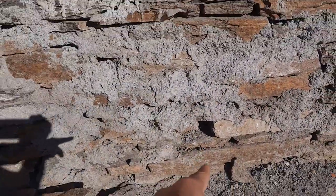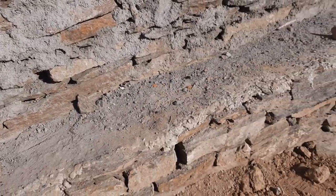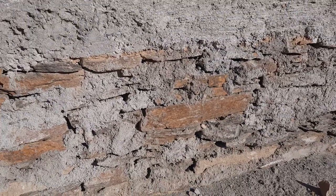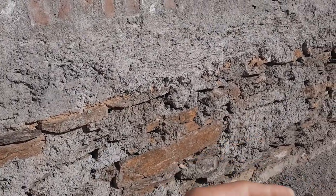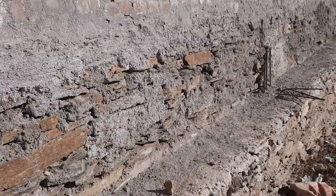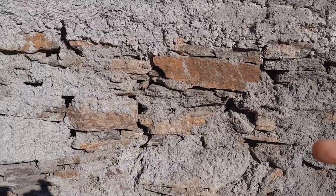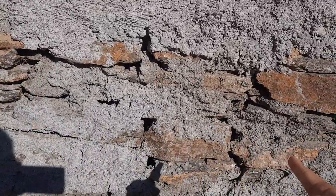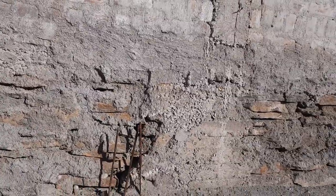As you can see clearly, they should do cement plastering. This is because during the rainy season, rainwater causes seepage inside the house — the rooms and everything. I'm guiding you about this important issue: they used a little mortar but they did not fill these holes by plastering. Cement plastering is very important for these types of foundations.